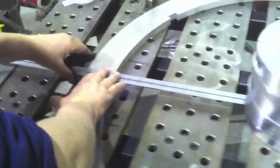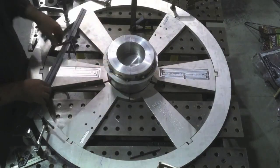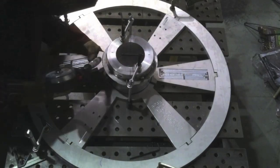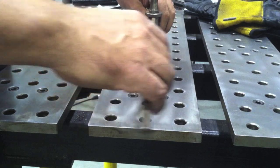In that earlier video, I had to make a big circle to line up a large aluminum fixture with an inner hub and outer flange where dimensions were critical. Using the same Build Pro table and fixturing, it made a complex job really easy getting the spokes lined up and indicated, centered up.